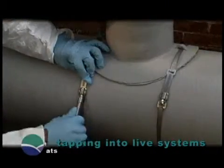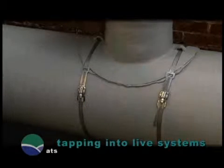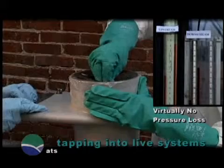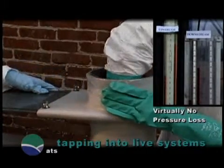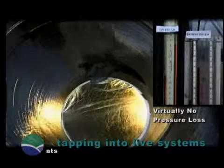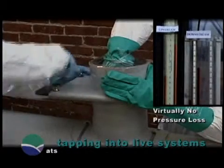Note: as the saddle flange is being pressed against the header duct with the draw bands, putty will ooze out around the saddle flange perimeter on the inside and outside of the duct. This excess putty will be used to seal the inside seam and protect the cut edge exterior surface of the header duct from chemical attack. Immediately slit the plastic covering in the branch opening and insert your gloved hand into the end of the tap. At the same time, lift the slide of the blast gate. Make sure you have donned appropriate chemically resistant gloves and gear. Reach in and spread the putty that has oozed inside firmly into the seam of the saddle and the cut header duct edge. Smooth the putty all around to form a beveled transition along the seam to provide maximum chemical protection.